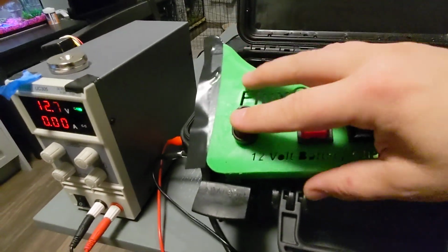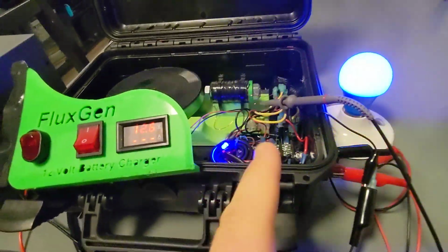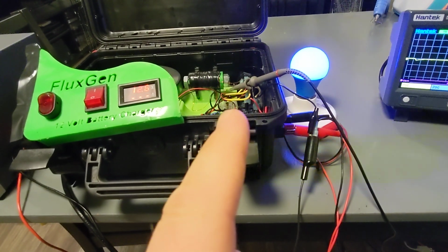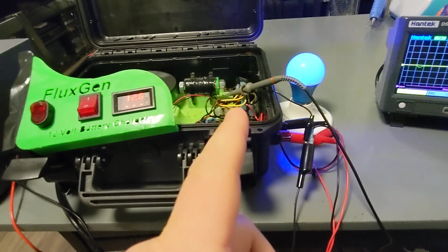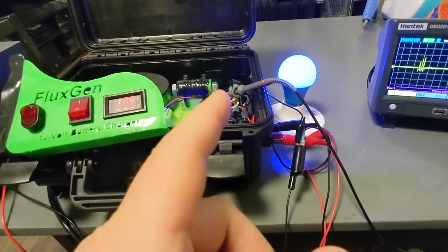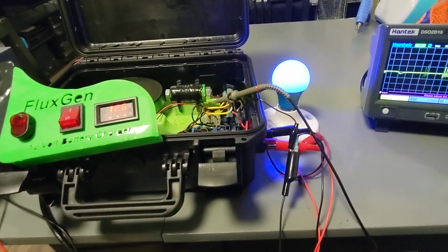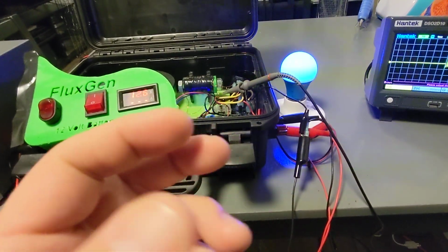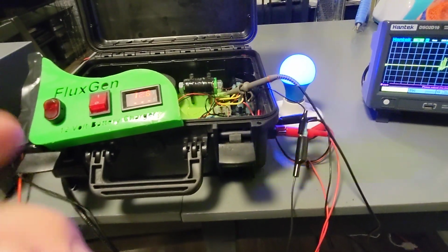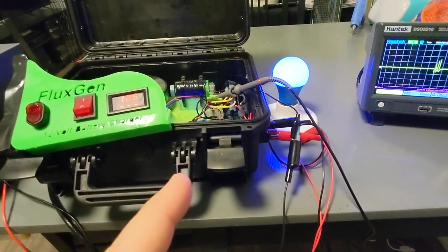Actually, I'm going to spin it in the other direction. Now, I've done some modifications. Oh, the transients I was talking to you about before. I'm figuring the transient spikes could be coming from the spark gap switch, the relay switch. That would make sense for those little transients in between, because of the feedback I'm getting from that spark gap. So that's very possible too. Now, if I hooked it up to a MOSFET, I probably wouldn't have those transients.